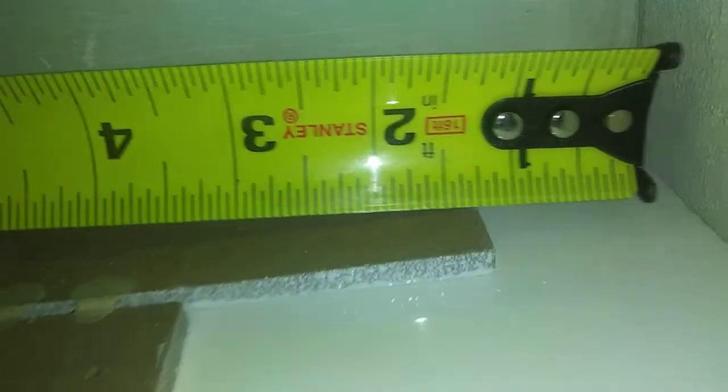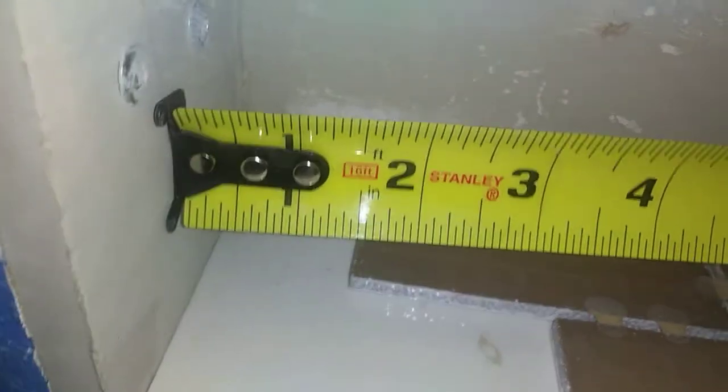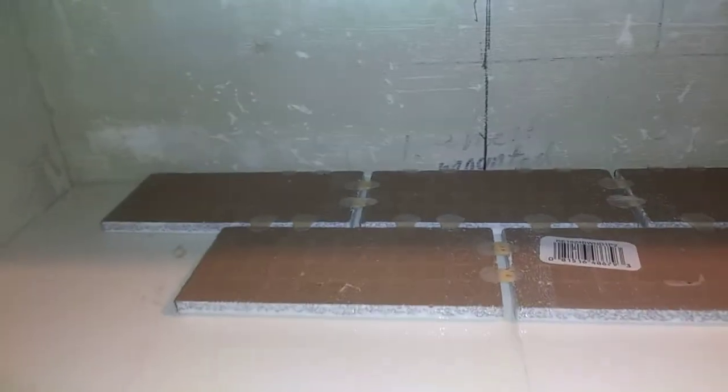Okay, you might be asking, why is it so important for this to be center? Now we have these ends we need to cut, all right? We want these as close to the same as possible. So here we have an inch and a half, and over here we have an inch and a half. All right, and that's why we do it center. Okay, if it was off by an eighth on either side or 3/16, you know, an eighth to a 16th is okay, indifference. All right, so that's your room of error, a 16th to an eighth.